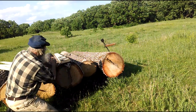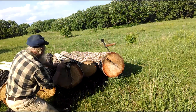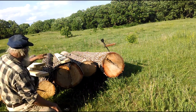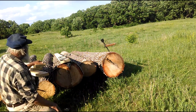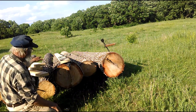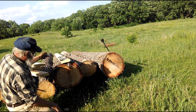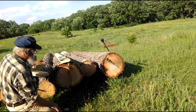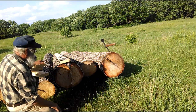I'll cut one way, turn around, and cut right back the other way without moving the board. It'll be a little setup since I'll have to use two boards, but it'll work. I'll just use the chalk line to get it right and it'll be a fairly smooth cut. These will be a little hard cutting because these are seasoned oak — very hard.